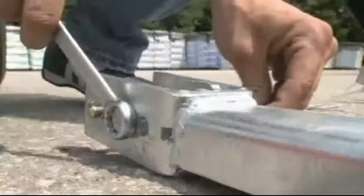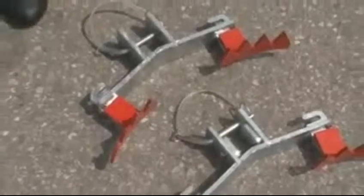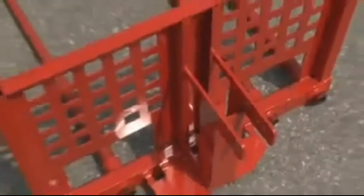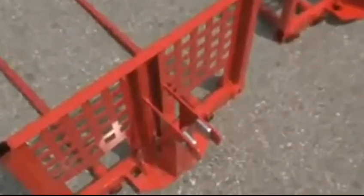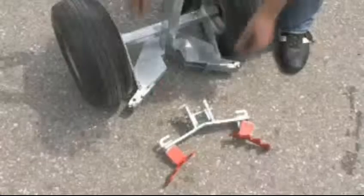The adapter plate is simply mounted between two guide rails with a bolt and nut, and using the securing pin as a protection against twisting. Attaching the adapter plates to the forklifter is based on the same principle. The two plates are bolted on the inside and are now suitable for a transport cart of size 1.